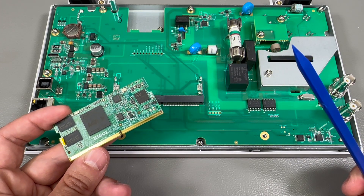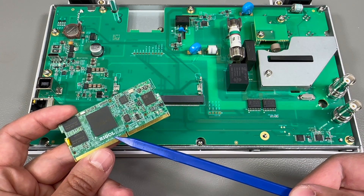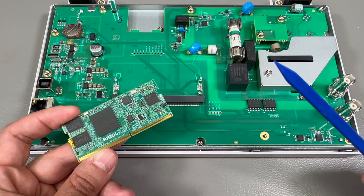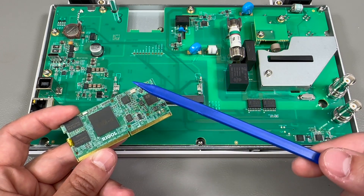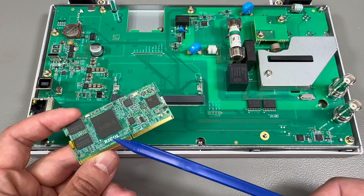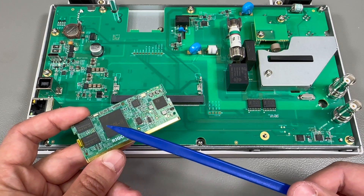The rate of defects could be smaller as well for a large batch of small 12-layer PCBs versus a large batch of big 12-layer PCBs. And if something goes wrong with the small SODIMM module during manufacturing, you only have to discard a small module, not the entire motherboard which might contain other more expensive components. You also gain advantages like being able to reuse this SODIMM module in other products, or design a new module for a different processor if this one is no longer available, or if you want to offer different RAM or flash memory — no need to redesign the multimeter PCB, just redesign the small processor module. All of this only makes sense at a certain volume and scale.